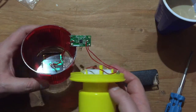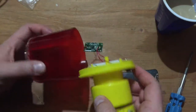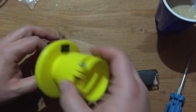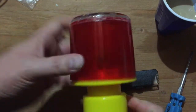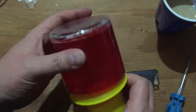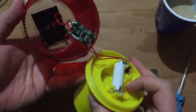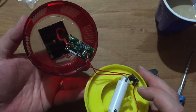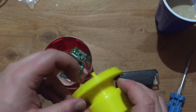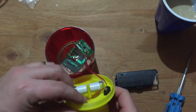It's not super waterproof. It looks like there's not a great glue job here, but probably adequate. I'd be more worried about this — there's no great seal here. Water would probably wick up through that and pool at the bottom. It wouldn't damage the circuit board right away, but there's no drain hole or anything in there. So a decent amount of water could collect before there was a problem, but it is just going to collect and not drain out. And also this switch here — I expect water would run down the side and capillary action would wick up through the switch and get in.